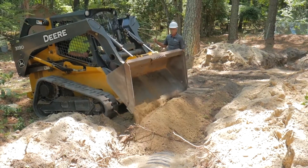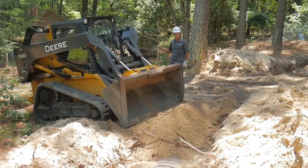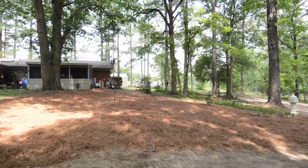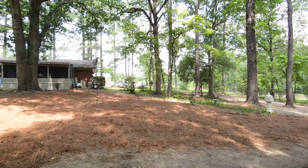It is best to leave several extra inches of soil over the finished grade to allow for settling. This also ensures that runoff water is diverted away from the system. The site should be seeded or sodded after the system is covered to prevent soil erosion.